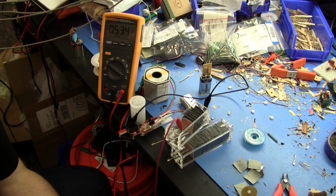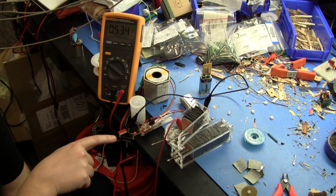I can now go ahead and manufacture a much larger number of plate dry piles, number of cell dry piles, and hopefully we'll be able to get kilovoltages out of these things. Now I also have the metrology sort of working so that I can measure the high voltages, or calibrate up to 500 volts. I'm obviously limited by the switches.